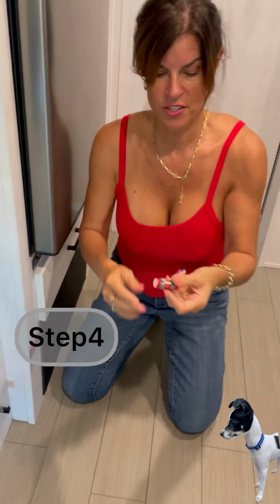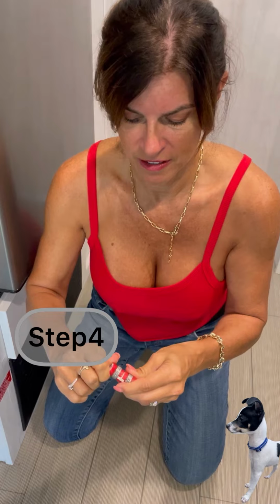So what I ended up cutting out is the connector. You can see I've got the two clamps on here and the connector in the middle. On one side they have PEX tubing, and on the other side, I don't know what they have. This is not PEX tubing on the other side. This is more of a flexible rubbery thing. One side is, one side isn't. So therefore that is probably what's causing our leak.